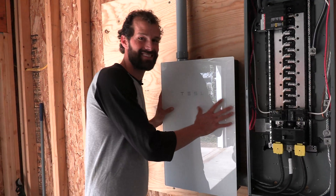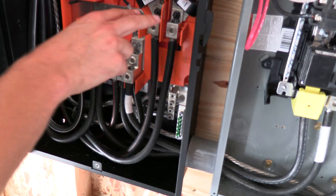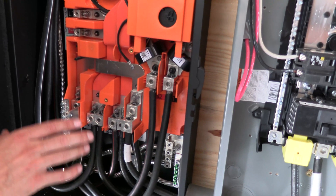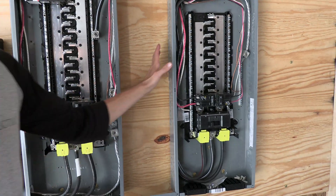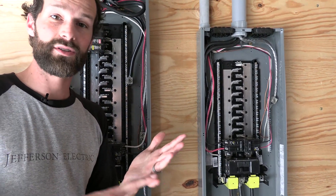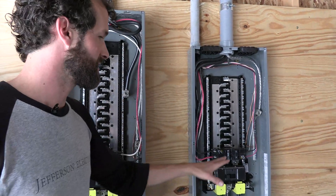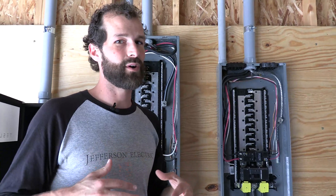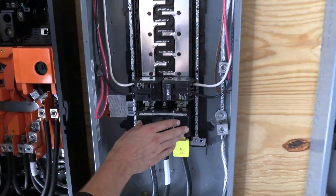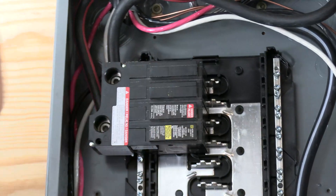Now we're inside the garage. This is the Tesla Gateway 2 — I've already removed the inside cover. Our feeder conductors are coming in from the outside here, L1, L2. Then we've got two sets of 200 amp feeds. One is to our generation panel — that is strictly for solar generation output, photovoltaic source, which in this case is the Tesla solar roof right above our heads. And secondly, for the Powerwall output — all energy storage. That's got room for expansion: 80 connected amps on 200 amp capacity, so when the customer tackles the home, there's no rework of the existing system. Secondly, we have a 200 amp loads panel here. These are two Tesla wall connectors installed in the garage for EV charging. And then at the top, we have a 200 amp feed-through kit, which provides power to the house.